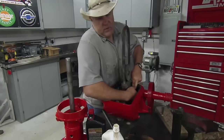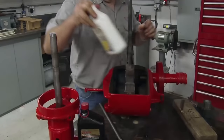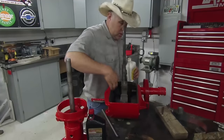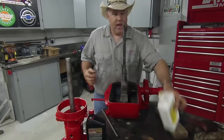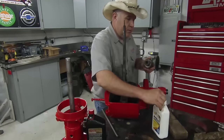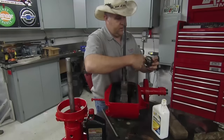This babbitt — this one that goes in here — is a bearing, and it has an indexing or locating mark so that it can't turn. I'm going to take some motor oil, second verse same as the first, get my finger in there and run it all around inside that diameter. Just pre-lubing it. There's a slot in there that collects a little bit of oil. I've got some in the slot. Let's put a little bit of love on it — some inside that shaft so that it slides in nice and easy.